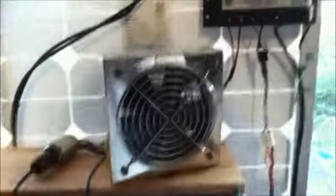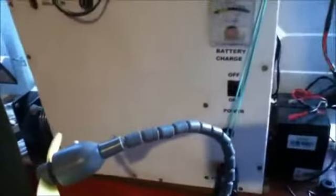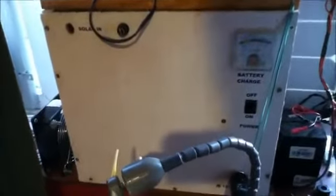But you could use this box, i.e. when you went camping, then you would have the charge controller inside the box and the solar panel would be on a long cable that you would just plug into a port on the front. I have done this in the past, that's why there's a hole labelled solar here, because there used to be a socket there. So you could use this to run phone chargers and lights and small things like this. With a system of this size, I would not recommend using an inverter of any kind, because it would flatten your battery quite quickly.